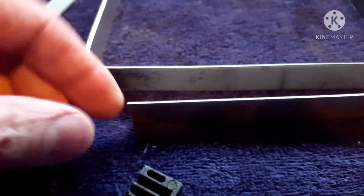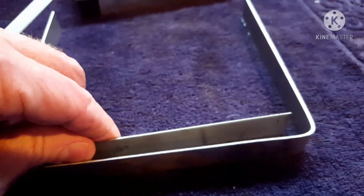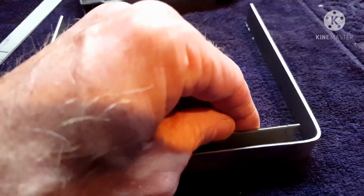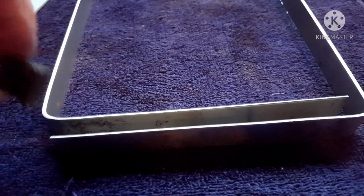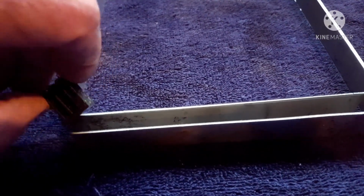So there's two ways you can deal with that. You can put tape around this electrode to protect it from this one. I found the easiest thing is actually to tape off the end of this one, and also to tape off the end of this one, so you don't get any stray currents that are slicing your electrodes in half. And then I tape around to hold the spacers in place, and let me show you how I do this.